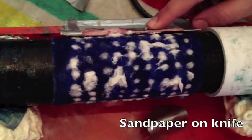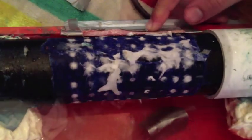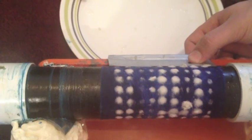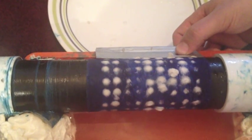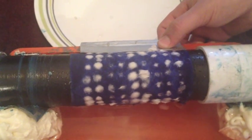We even placed sandpaper on the edge of the knife to provide more grip, but the solids roll down into the drum housing instead of onto the knife. If a different slurry was utilized — such as clay and water, or mud and water — a thicker cake could be made and properly collected.